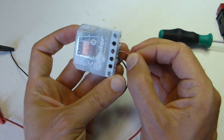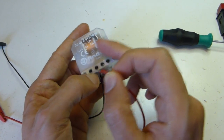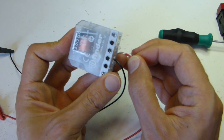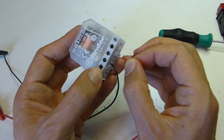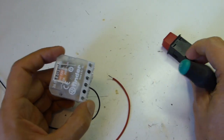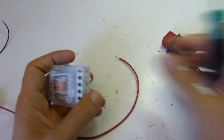When supply goes into the coil, it creates a magnetic field that moves a lever. The lever makes this plastic part rotate one step at a time — one step for each pulse. For each step the switch here will open and close. With the 12-volt power supply you can check the relay without the switch. If one of the two doesn't work, you know which one.